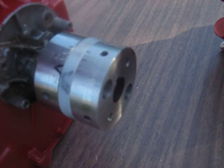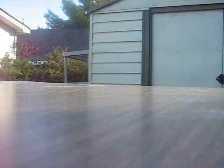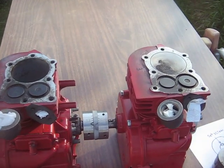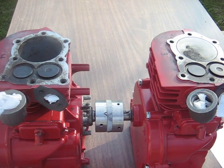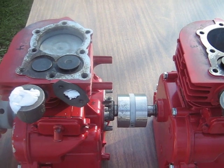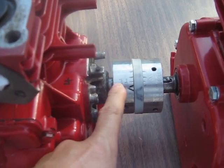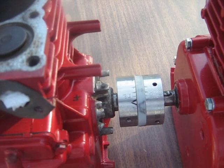It doesn't look like all that much, but it's been a lot of hours making these couplings. When I assembled the number three and four cylinder here — just watch close the distance between the top of the cylinders here — you see it wiggle there, move back and forth. What that's telling me is that the end of number four crankshaft appears to be warped, and that's causing me some grief.